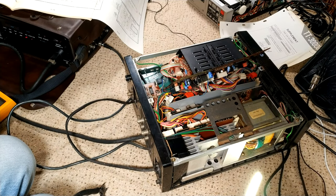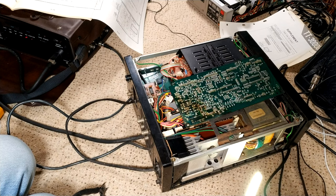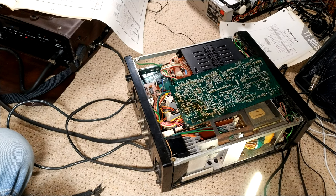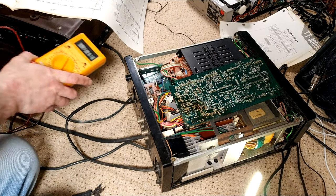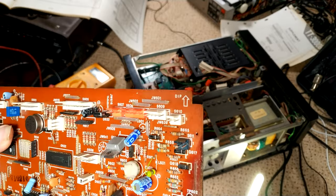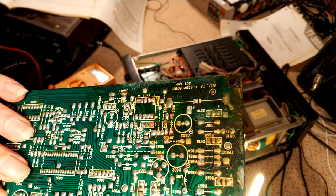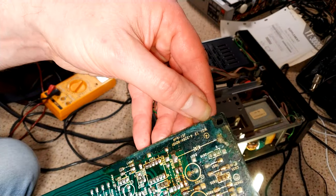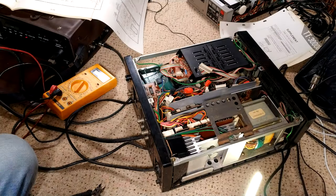Has anyone ever been into this machine before us? Probably. So it is actually voltage across it. Wow. It's actually 1.5 volts still across it. So I'd better be a bit careful with that, because it's a little short, really. Greenness. So you can see it really is quite green. Quite nasty. Lifted the track there. So let's give it a clean and see what happens.